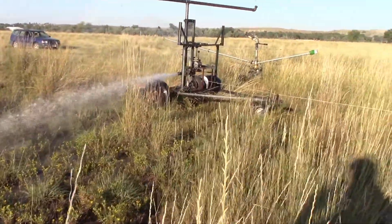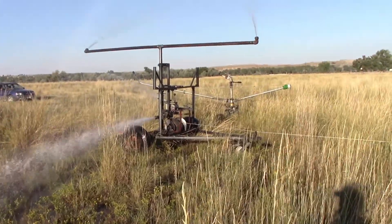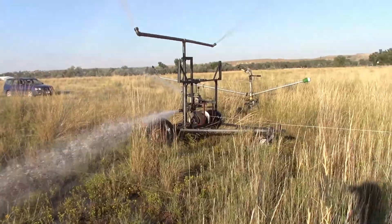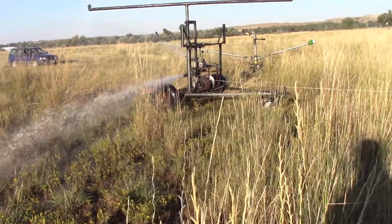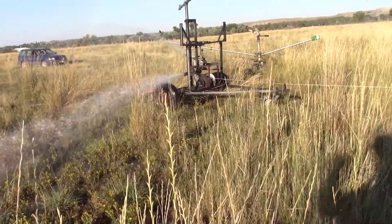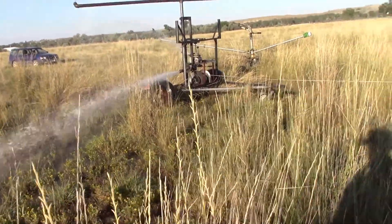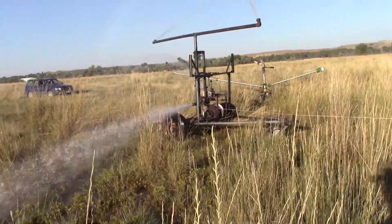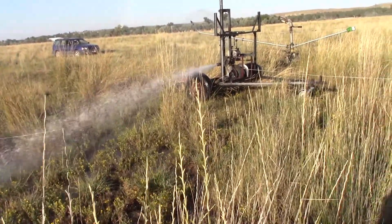And also what I did different on this — the Williams there used like a cam system, a kind of hammer using momentum to ratchet itself forward with a double ratchet. I modified it to a single ratchet on that Magnum to slow it down, which put it close to about what I needed. Then I modified the stop so it only ratcheted one tooth instead of two on the ratchet pawl system. That's what I wanted to get away from because I kept having springs break on it. And this one's just straight raw torque.